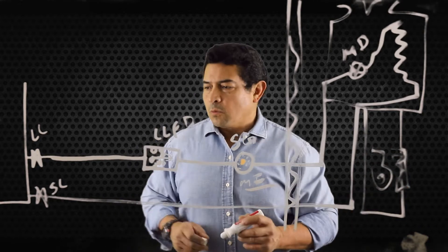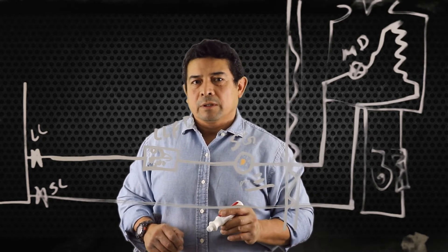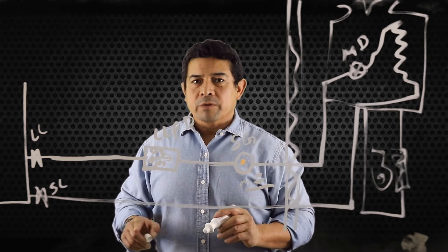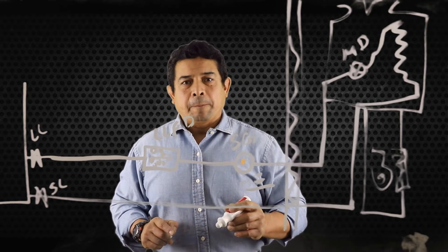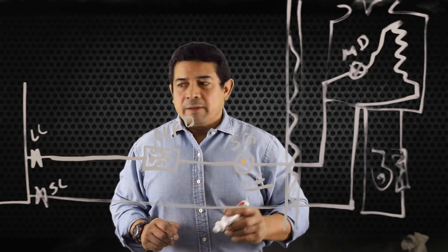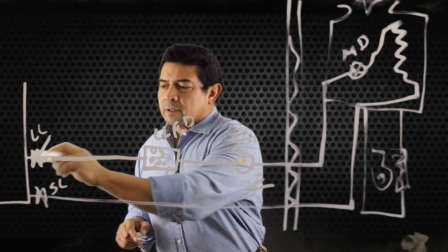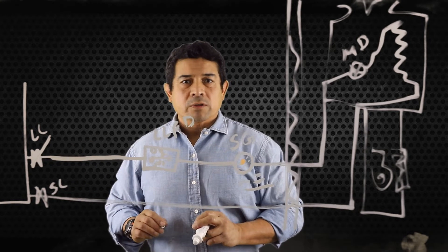So now, what are we going to do here? We're going to talk about not recovering the refrigerant — we're going to save the refrigerant, not recover it. So what we're going to do is pump the system down. That means we're going to shut off the liquid line service valve here and close that off so that there is no more flow.